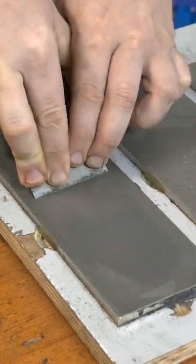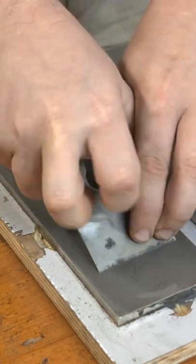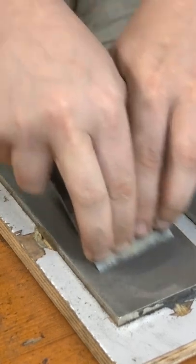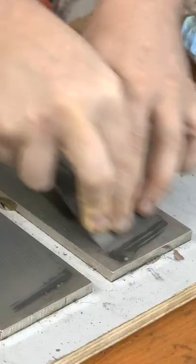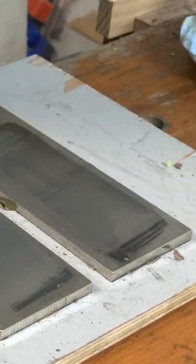So this is regular sharpening, and then corners — just releasing this side, now changing to the other side and the center. Then simply do much, much quicker sharpening on other stones — light pressure, light pressure, and that's it.